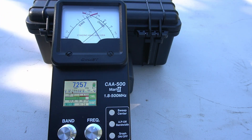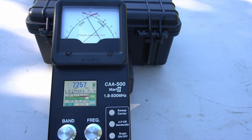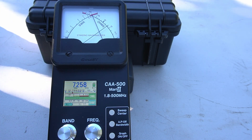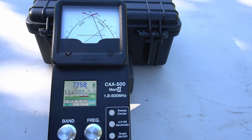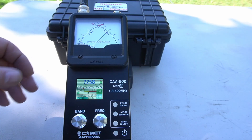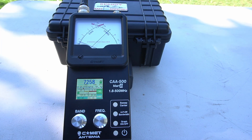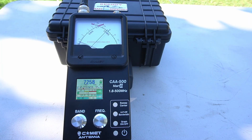As you can see, we are at a little over 4:1. I'm going to go one notch at a time. I find it easier to do it by putting my thumb against one side and moving it towards that side. So we are going to go shorter. I should have changed a little right there - I did one. Sorry for the noise, it's garbage day here today. So now I'm away from it. Hopefully we're down in a decent area. I had this a minute ago which is perfect. Alright, I am two notches in from the red line for 40, and I'm at like 1.4. That's good. We're going to start there and lift it up. By lifting it, we went down to 1.3. It's about 12 feet high. Let me hook a radio up to it and see if my buddies are on down in San Diego, LA area.